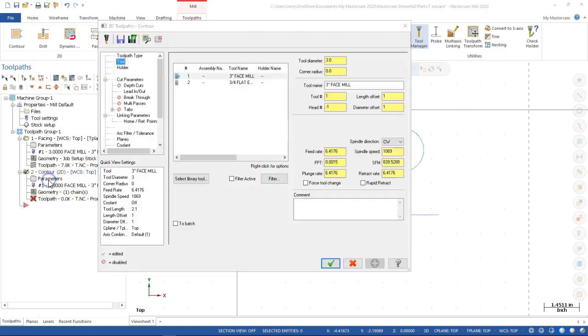All right, come back to the parameters. Have the tool now. I didn't set anything as far as the speeds and feeds on that one. So even on the TM, I'm probably going to run that at 4,000. And the feed rate, if I was on a more rigid machine, probably would be about 30 to 40 inches a minute. We'll drop that down to 20, and I'll leave the plunge rate at 20, and we'll go to rapid retract. So this will be my roughing pass, except my caps are on, so let's get that in place.